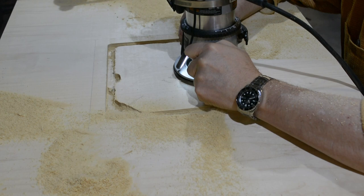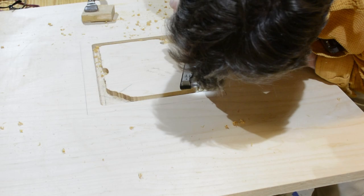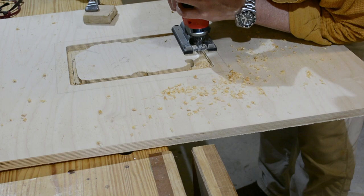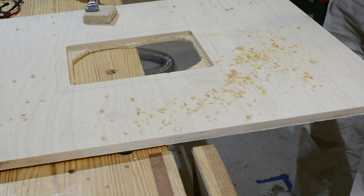I positively hate routers — oh, dusty, dusty things. With the field removed, I can now go in and cut out where I had made those marks previously. I have to redraw them once I cut. I'm just using a simple jigsaw here, and the process is not one for accuracy — you just don't want to cut too much, because you can always go back and cut more but you can't add it back on.